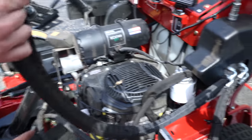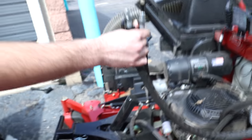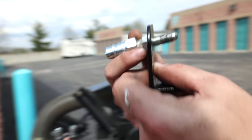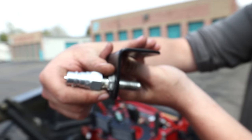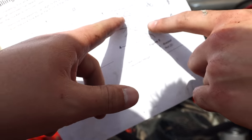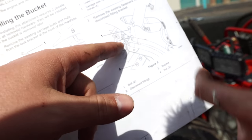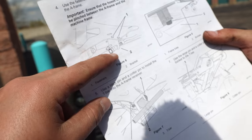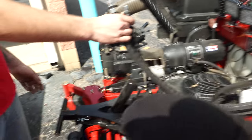So just so you guys know where we're at — about 20 minutes later for us — what happened was the bracket: originally the hydraulics are up top and for the mulch force we're going to have to invert it. But the problem is when it's up here, the big one is usually on the left side, the little one is actually on the right side. So when we try to flip it over, it's oriented wrong. Plus there's just a lot of tension on the hoses. So what we had to do is get the large quick disconnect to the outside — we had to basically remove the quick disconnect. I was actually talking to the Toro team, the Toro engineers, and they might have to update the manual a little bit. You might have to take the tip of the quick disconnects off, and then that way you can get the hoses kind of inverted.